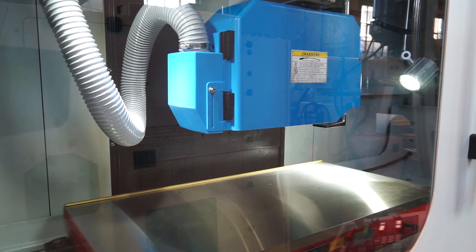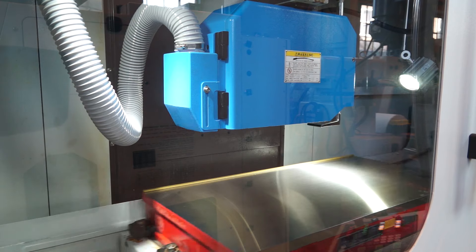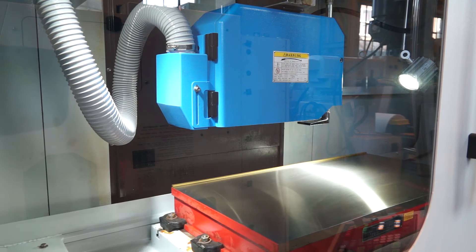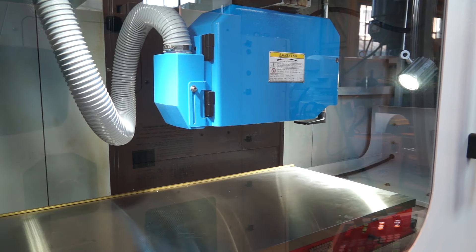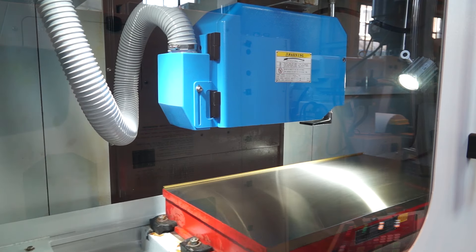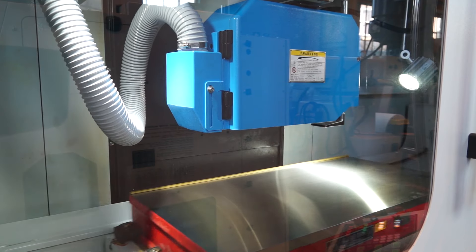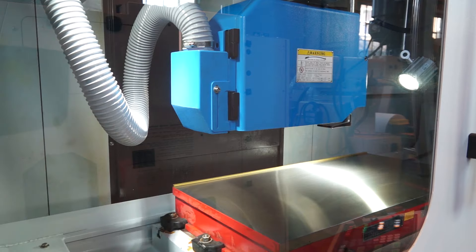You mentioned column machines — so are we saying that the grinding wheel is moving backwards and forwards? That's correct. On a column machine, the head will move from left to right, back to forwards, table left and right, and the column up and down. On this size machine, the up and down movement is servo controlled.